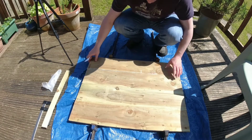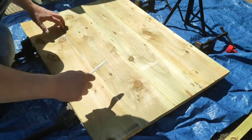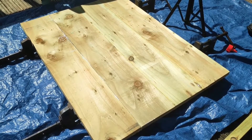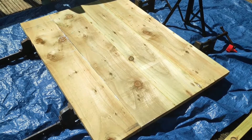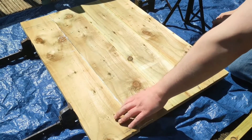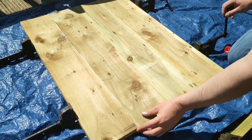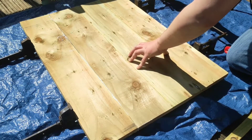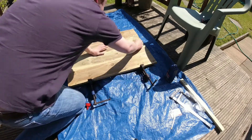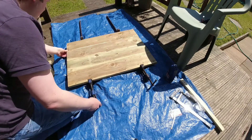Now I'll offer the two pieces of timber up to each other, introduce them, and try to align the piece of wood within the sash clamps. You'll see a bead starting to form already between both pieces of timber. I'll do the first clamp of the boards — you want it to be a fairly light clamp, because the idea is not to compress all the boards together hard, just to apply enough pressure to maintain a bead of glue between both boards until it sets. If you tighten down too much at this point it'll force all the glue out and you won't get a good glue-up.